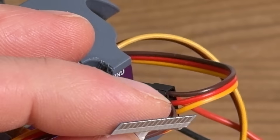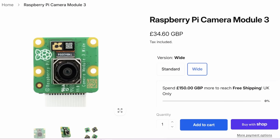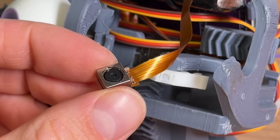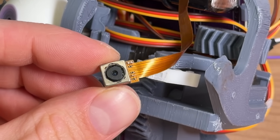First I needed to find a camera that would work with this board. When I was using my laptop I used a USB camera, but this board works with a 15-pin CSI connector. The good news is that this is super common — it's the connector type that the Raspberry Pi 1, 2, 3, and 4 use, and most Pi cams use it too. The bad news is that most Pi cams come fixed onto a clunky PCB and the connector itself is too thick to fit inside my eyeballs. I ended up finding this 22-pin slim camera which is a much thinner connector despite having more pins, and it has all of the components soldered onto the flexible cable so it fits perfectly inside my eyeballs.